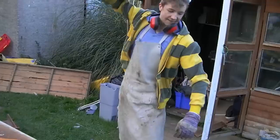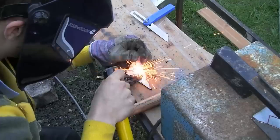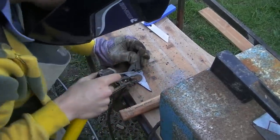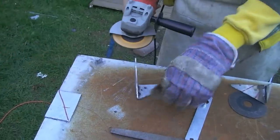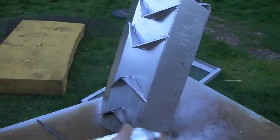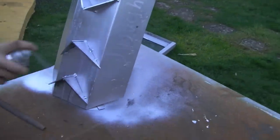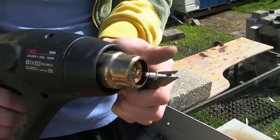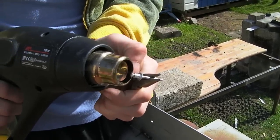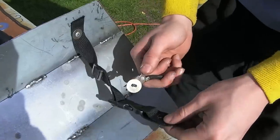At this point you've finished your build but we'll be adding a few more features. Cut out some spikes from any leftover metal and then weld them together into pairs. After cleaning up the welds with the grinding wheel, weld them onto the shield, then go over the entire thing with some paint — it'll look better in black but all we had was silver. Finally, add some straps for stability. Drill holes into the shield for the mounting points. To create the holes in the straps, we heated a rivet with a heat gun and pushed it through the nylon straps.